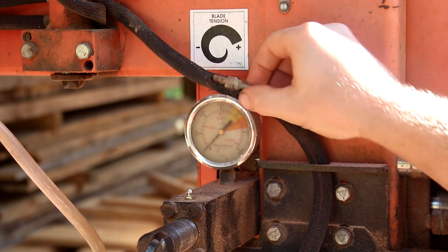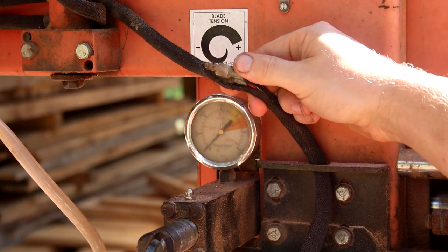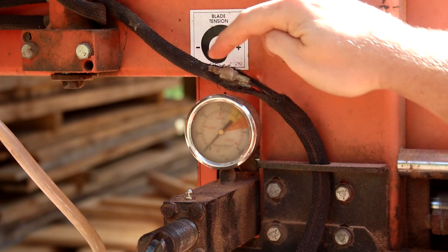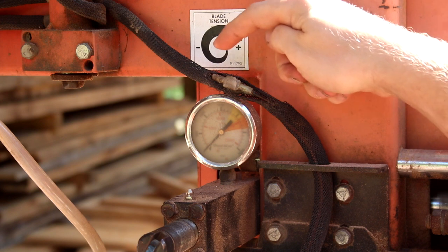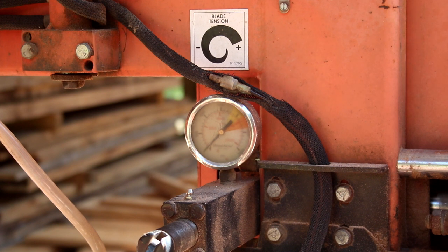Take these apart — unless your machine has been modified, you're going to have butt connectors here. Make sure that on the motor end — not the switch end — you're getting power to your motor. If you're getting power to both leads, the problem could be the motor itself. In my case the motor was working one direction but not the other, so it didn't make sense that the motor was totally bad.